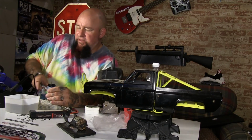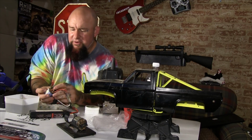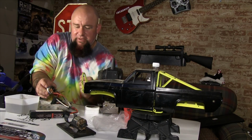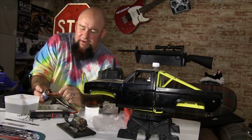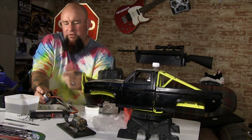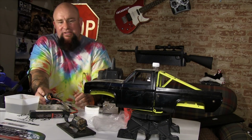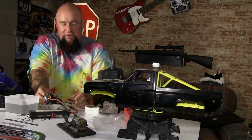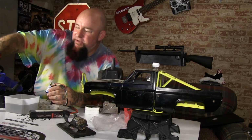And then if you want to get real specific about it, this is going overboard with it. You have a couple screws here where you can take out and pull your end bell off. Some interference and glitching with my radio there. You got a couple screws there, you can pull your end bell off. You can oil and lube everything from the inside. It's not necessary, so it's not something I would necessarily recommend doing, but if you just wanted to do it for the reassurance and the extra peace of mind knowing that, hey, enough oil got into it.